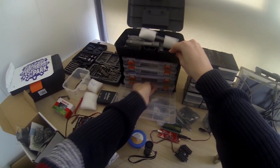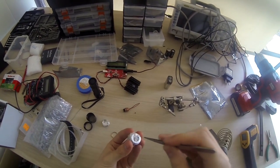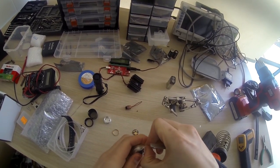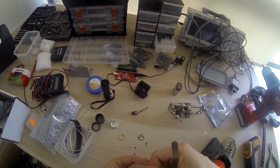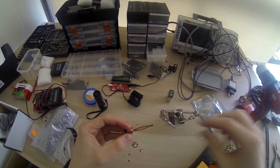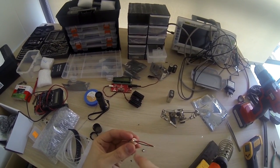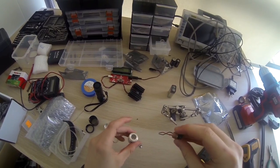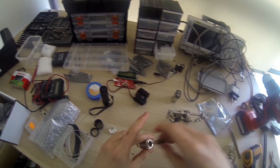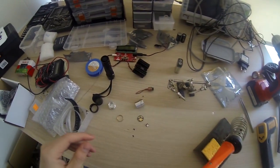I'll use this thing as a heatsink. It's built with this host in mind. The laser diode module is 12mm in diameter, so the diode will just slide in there, and then this will connect to the driver. Let's start with the driver.